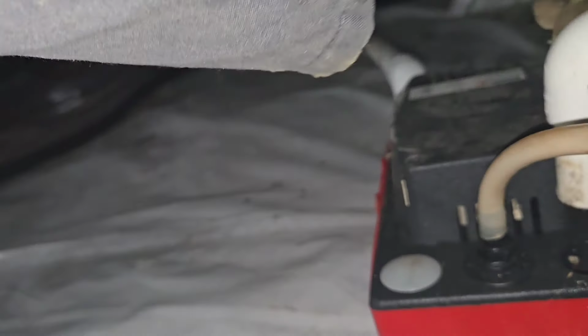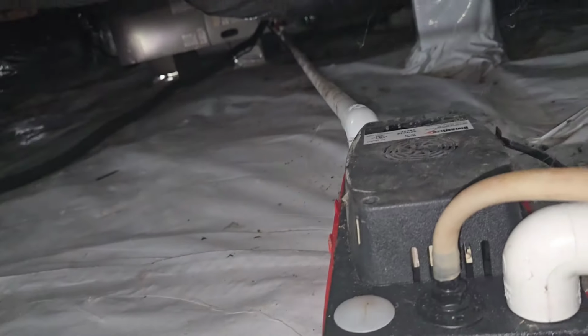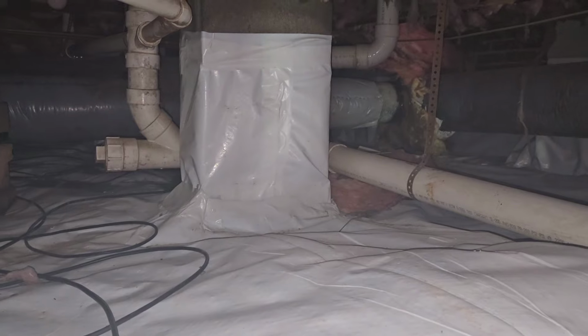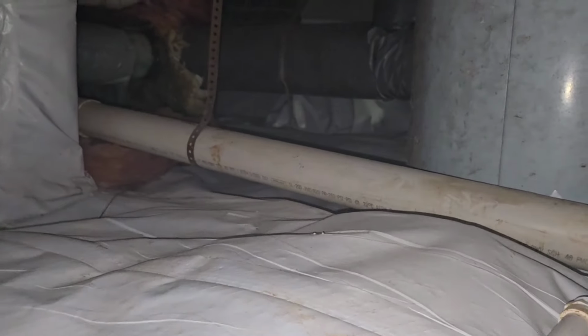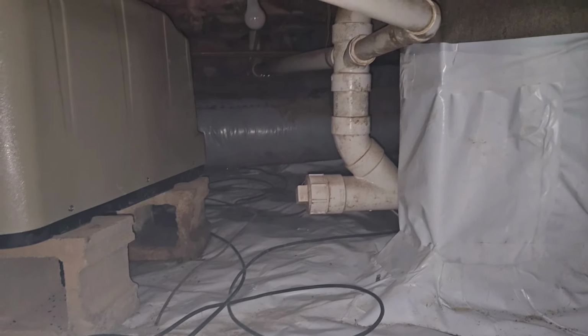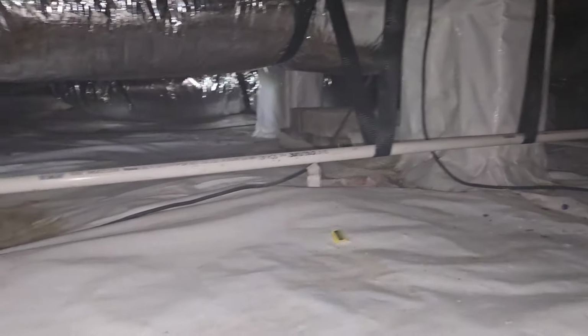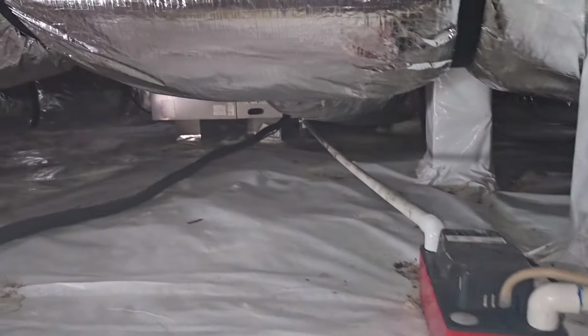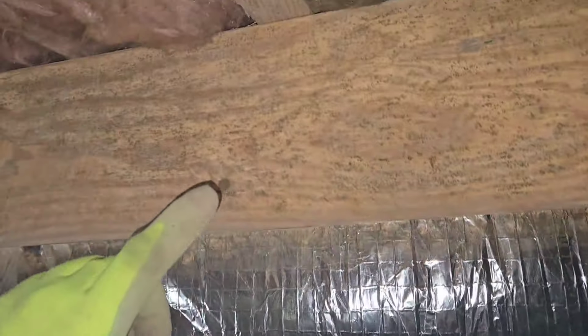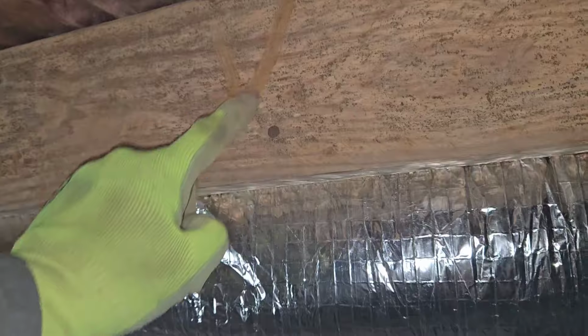And you definitely shouldn't be sharing the discharge line from the dehu and the discharge line from the AC into one condensation pump with that little hose. Who knows where that goes there? HVAC company usually knows that, man. They usually put their own little system there and they just run it out away from the home. Who did it first? People who did the encapsulation or the people who serviced the HVAC? Doesn't matter. There's some fungus right here.